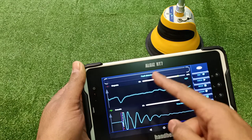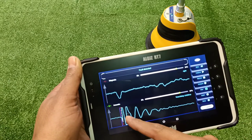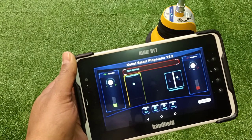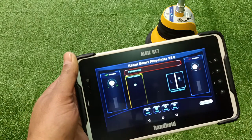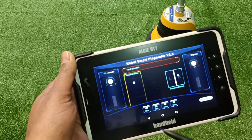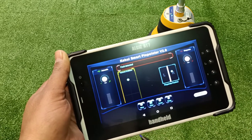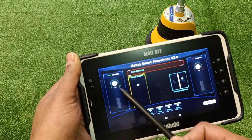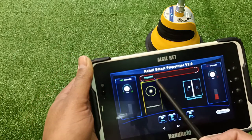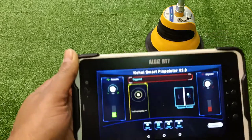Once on the fault location, the triggering indication changes and the acoustic and magnetic waveforms update in sensor mode. You can see the fault is identified at 0.625 milliseconds, which is exactly the fault distance. The sensor is placed on the right side of the cable. It shows the strength of the acoustic and magnetic signals, and displays 'fault detected.'